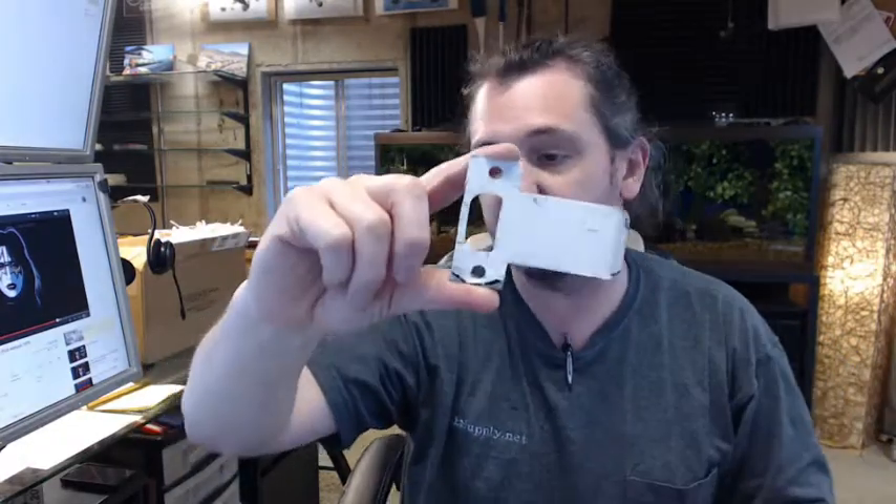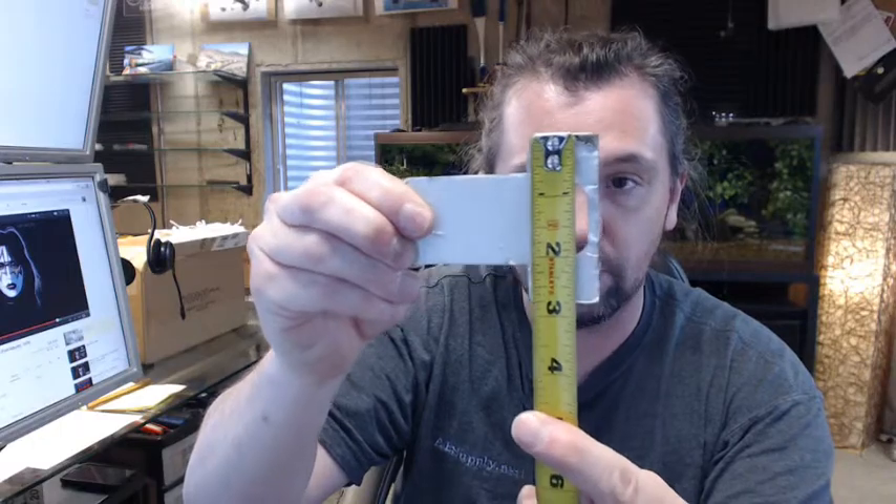Here is a magnet — as nonferrous as stainless is. It is 18 gauge material. Being a T-Strike, that means it is 2 and 3 quarter inches tall, and this is a 3 inch extended lip.